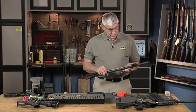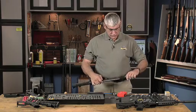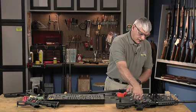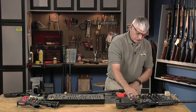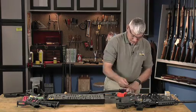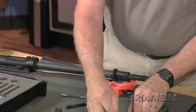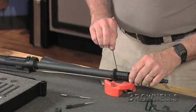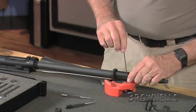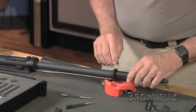Now we want to make sure this is indexed properly. Look down at it — there are nice level surfaces. This is secured with two set screws. You'll need to use an Allen hex key to drive those set screws in. It's a friction fit, so a 3/32-inch Allen key. Just cinch those down, get them in place, and lock that in position.